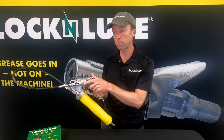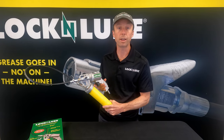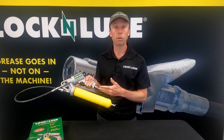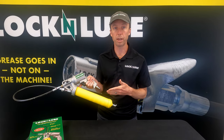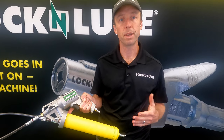In single shot mode, you'll get higher pressure — about 6,000 psi. The thing to consider with any pneumatic gun is the air pressure and input pressure from your compressor. The operating range on this gun is from about 40 psi all the way up to 120.